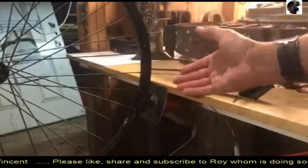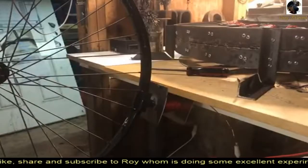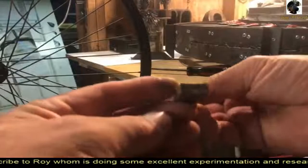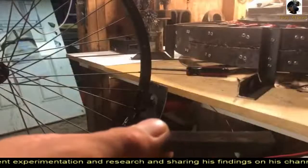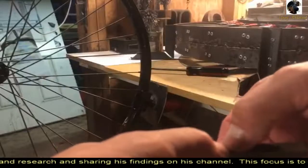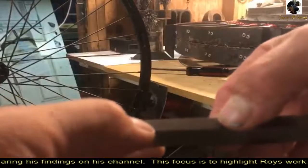What I've learned is when you have a core, like the core we're using, right? When you have a core, the laminations right here, there's about 15 laminations in here. You see those laminations. When you have a core like this and you wind it cylinder-like all the way around, you keep going, keep going, keep going, the concentration of the magnetic field will be in the center of the core if you have a core in your coil. And it'll focus there. But you can move that if you do a conical winding, where you're fat on this side and conical down to the center. And that's what we created with those two coils.